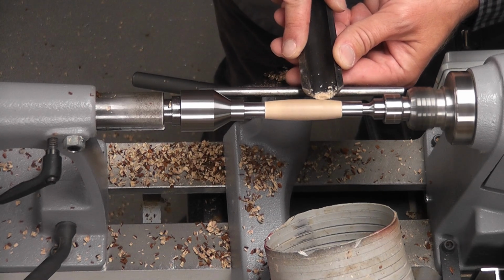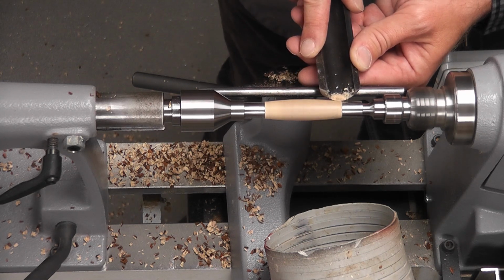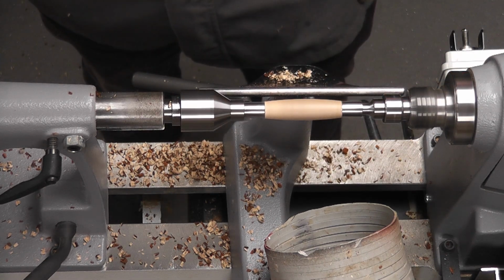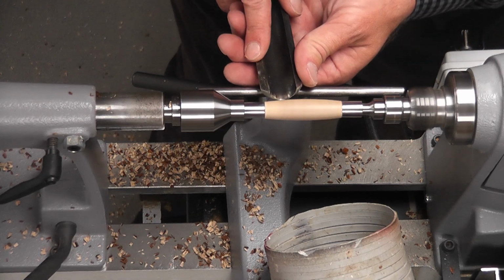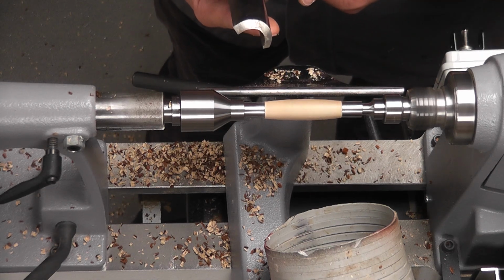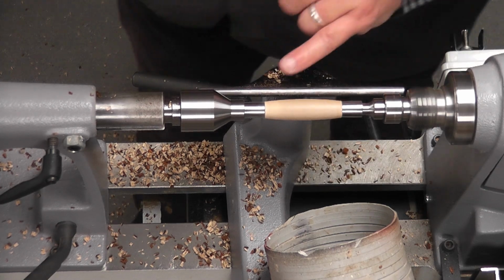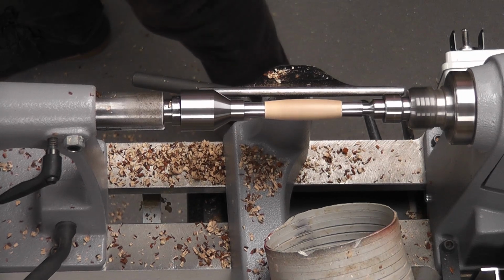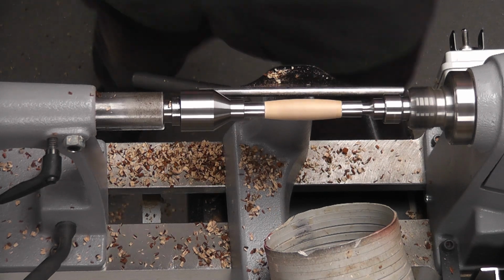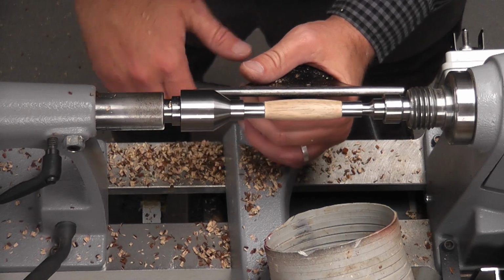It's going to give us a really nice finish, and I can see the kind of reflective quality of the timber just kind of come up to a slight shine. And that's a bevel rubbing cut, and I would generally stick with this chisel or gouge and take that down using that bevel rubbing cut. If you've got a little area you're a little bit worried about, you don't want to get too close with the roughing gouge, we can always do a little bit of scraping.